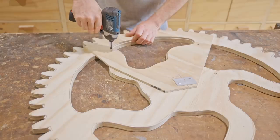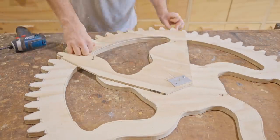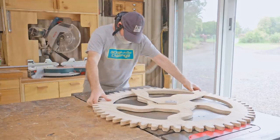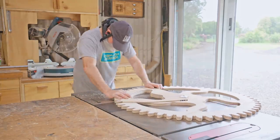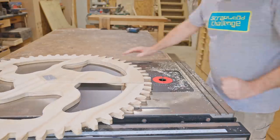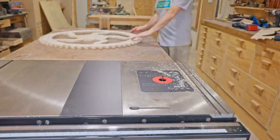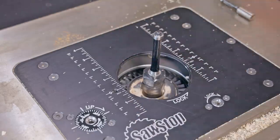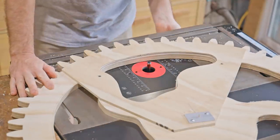There are 55 teeth on this cog so there are a fair few to do, but I reckon this is much easier than joining the teeth individually like I did on my other wooden cog. To route out the openings I'll swap out the quarter-inch pattern-following bit for a half-inch one, as it will cut easier and more efficiently, although the quarter-inch bit did do a great job.